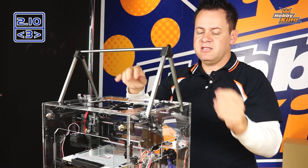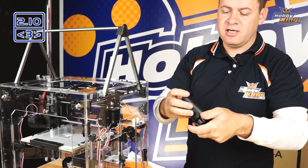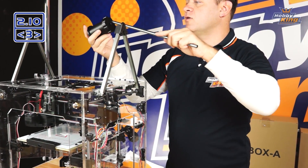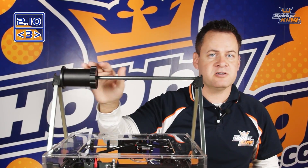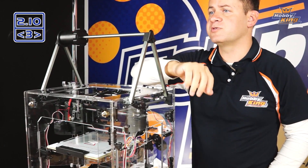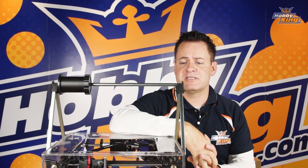Those two little cutouts right there are just for the axle. And this is your spool drum — what's really cool about it is a quick-release right here on the thread. You just drop your spool into that, put this on, and you can go ahead and load that right in. You can pick these up as a spare part, and what's really cool is having a couple of different colors if you're doing a multicolor print. You can have a couple of spools loaded up on here ready to use — just pull it down, clip one out, extract it, put the new color in, and continue printing with a pause print feature. You can have a couple of different spools, different colors, even different materials — PLA, ABS — they even have wood filament out there now that you can actually print and sand. Pretty awesome.